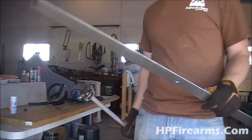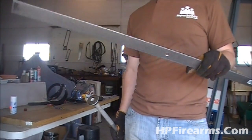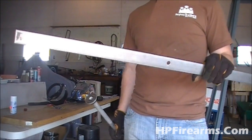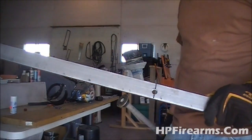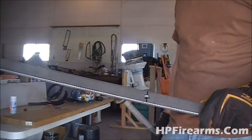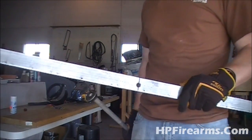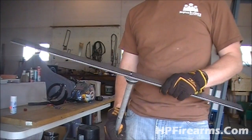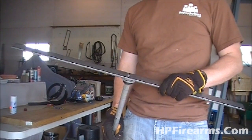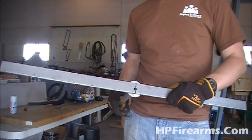What I have here is a piece of quarter-inch thick, inch-and-a-half wide, standard weldable steel. I've marked it right in the middle — it's 36 inches long, so we are at 18 inches in the dead center. I went ahead and drilled a hole in the center of it so I could line it up when I welded it on here with the hole in my pipe, so that I can still run my wires down through the center of the pipe.